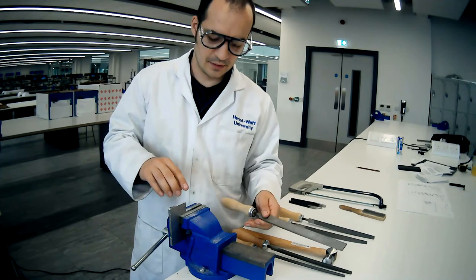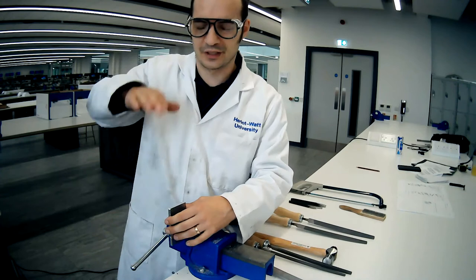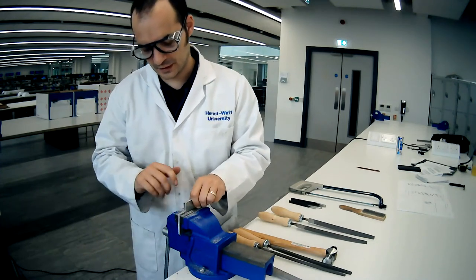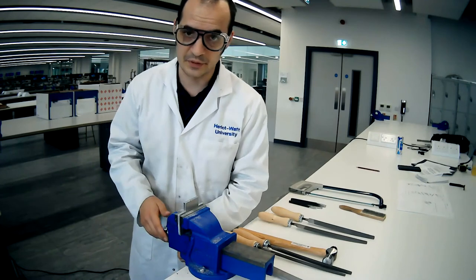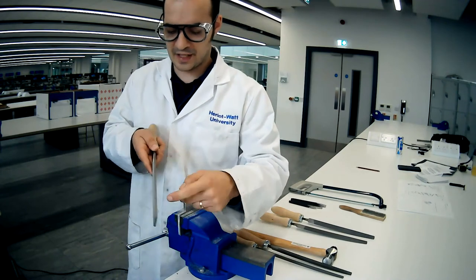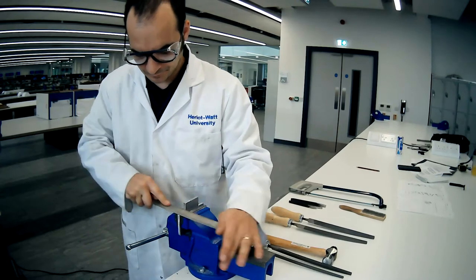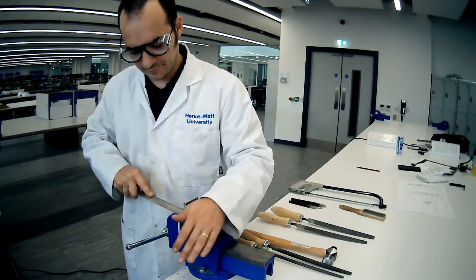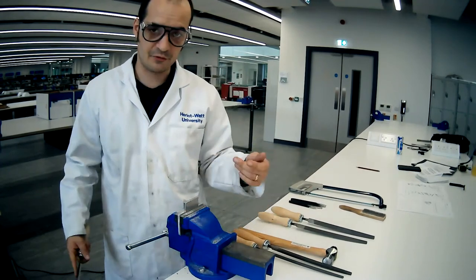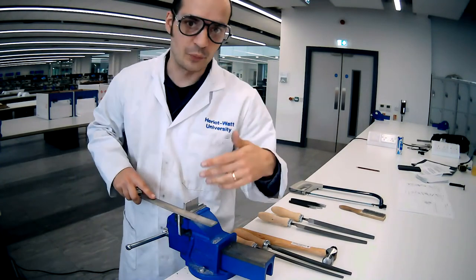For filing, like sawing, you always ought to be doing it in a downwards plane. Loosen that off, have a look around - again as low in the vise as you can, nice and tight, flat edge up against the wall. For both sawing and filing it's worth stopping, getting down to eye level, and making sure that you're not beyond where you're wanting to cut.